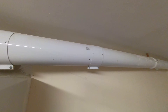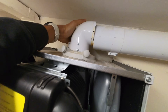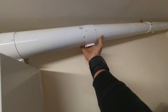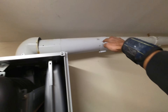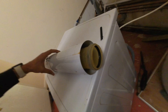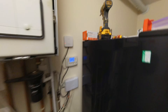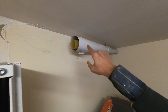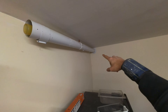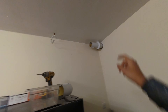I hope I don't have to replace the whole section of flue, hopefully just a short section, and hopefully I can get away with just replacing the seals. But if I have to replace the whole flue, it's still got to be done one way or the other. Some clever clog has screwed around the back as well — managed to slide that off, you can see the staining. The elbow has not been screwed out the back, which is good. The rust is coming from further back, so I have to start disconnecting another section, basically keep going until I find where it's actually split.